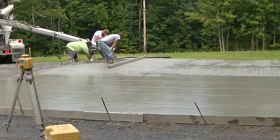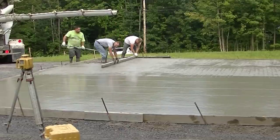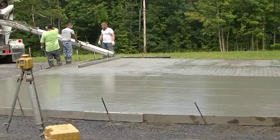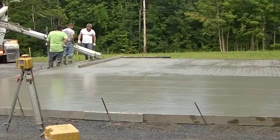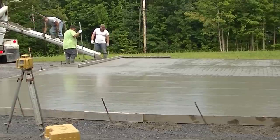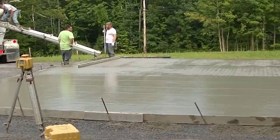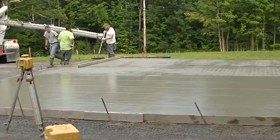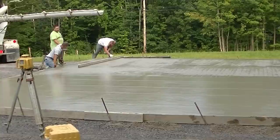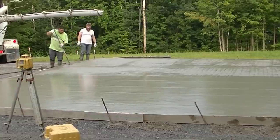Darren's screeding right off the top of a two-by and I'm doing the wet pad thing in the middle — I'm kick screeding in there. This will end up being a three-bay garage with three nine-foot doors in the front and a three-foot passage door on the side over by the laser. In the next video I'll show you how we go about tapering the garage doors and how we power trowel something like this to get it really smooth. There's also in-depth video training like that in the Concrete Underground.